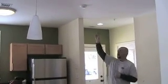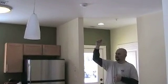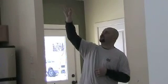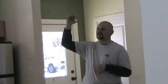If this device, the heat detector, malfunctions, there will be a trouble signal in the fire alarm panel in the sprinkler room, notifying that there is a problem, a break in the line. If somebody does damage it, there is no light, no indication that there is anything wrong, but an ounce of prevention is worth a pound of cure. If there's a question, this device is easily replaced, and it's better to be safe than sorry. If it goes off, then the fire department is notified. But if you break the line, there's a trouble signal in the fire alarm panel, and somebody would have to come in and find out where the trouble is, and it could very well be in the device.